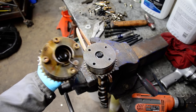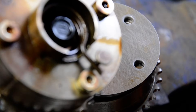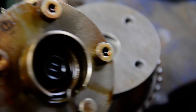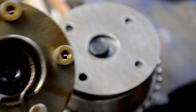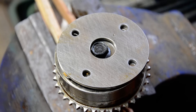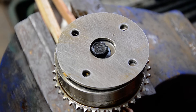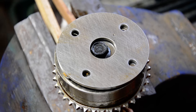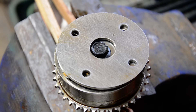You can kind of see it's a five-star bit bolt. I don't have anything like that — I only have Torx and allen keys. I tried everything: I tried a straight blade, I tried the Torx — the Torx are six-point, allen keys are six-point. I couldn't find a straight blade that would get it out; it just kept popping out. I even tried making a bit out of a bolt, that didn't work very well. So I just had to bite the bullet and drill out those four bolts.